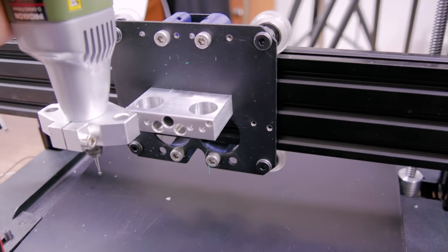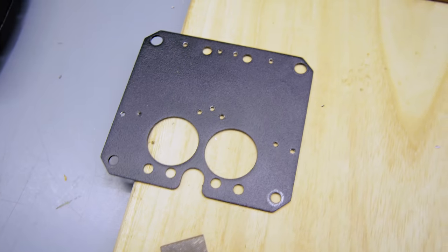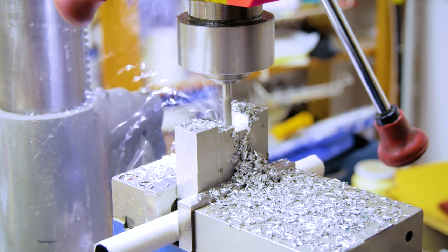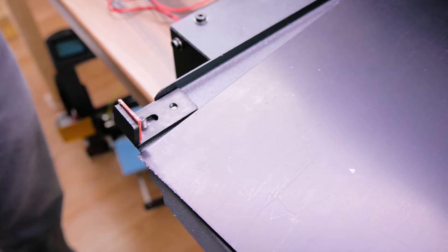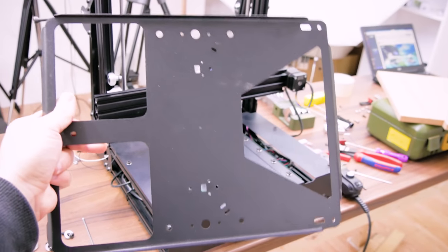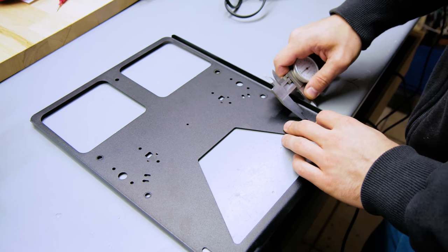go. The great thing with these OpenBuilds wheels is that you really don't have to work precisely at all when it comes to the positions of the mounting points for the wheels, since you'll adjust the pre-tension of the wheels anyways. We also stiffened up the print bed, since again, that was simply sheet metal from the factory and didn't come with any significant stiffness. To make it less prone to twisting, we spaced out the OpenBuilds wheels a bit more, which does make the Y-axis a bit shorter, but that's okay.